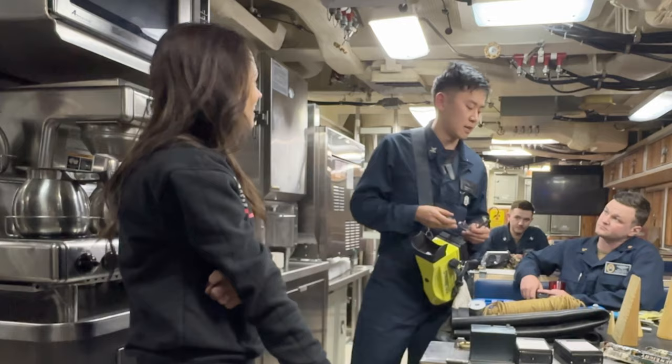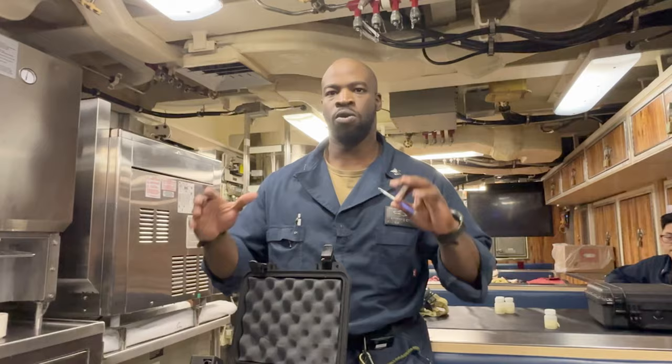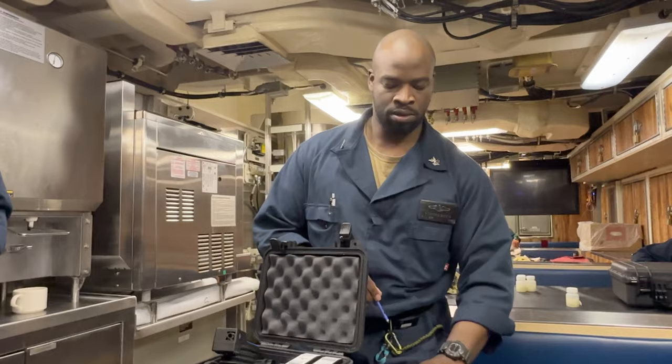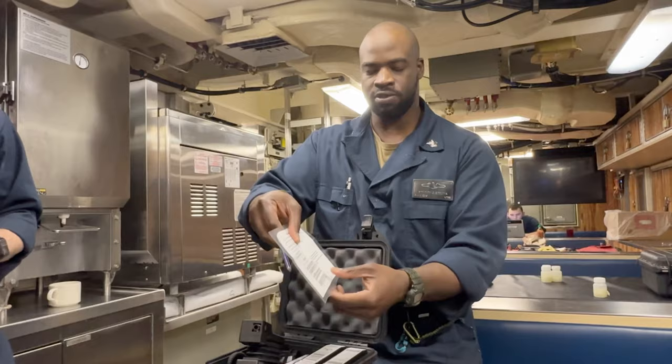Cool. Now, after you put the fire out, you could still have a problem because when things burn, they can create harmful gases. And so now you need to test the air. So what'll happen is we'll put the fire out, we'll ventilate the space, and then whatever kind of fire it was, we'll use our nifty little table here to say, hey, this is the gases that we need to test for. Wow, okay. And then we'll test for those gases.